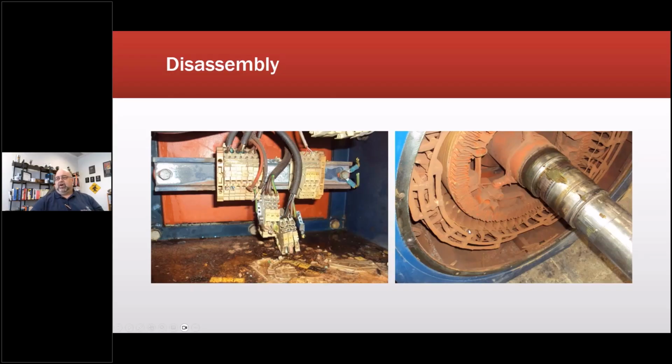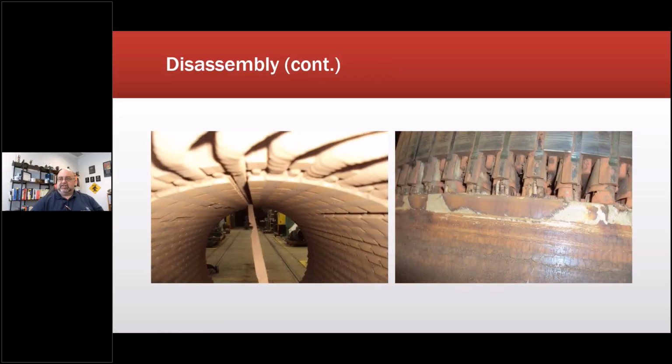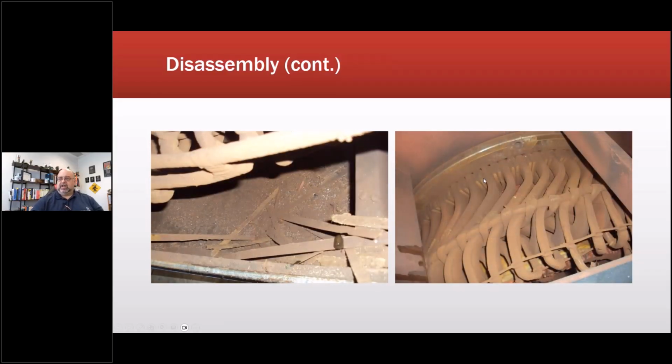And then all of this rusty colored dust in here, that is remains of wedges. So that's all wedge material. So the magnetic wedges, as it turns out, okay, I don't have the picture. I put a magnet in there and picked up all this material. It's all ferrous material. There's a neat effect that occurs with ferrous materials.